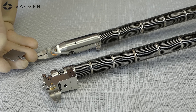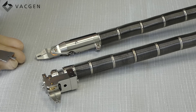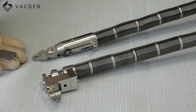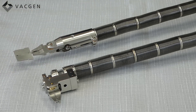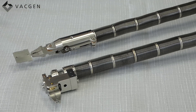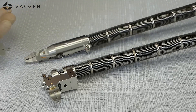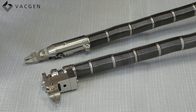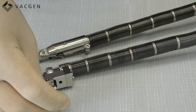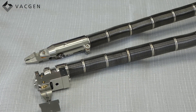Some people call them pan handles. You will notice this part on the end — this is the part that is actually gripped by the gripper or the pincer. When I operate this, the pincer opens and this will allow this to be gripped. This will not fall off; it will stay on there until it is activated again and then you can remove it. On this version it operates the same — using the actuator on the end the jaws open, put the sample in, and in this case you can see the angle it is at, running parallel with the jaws.